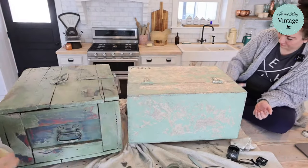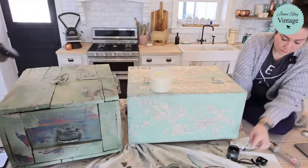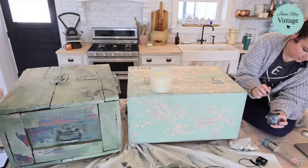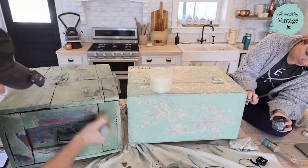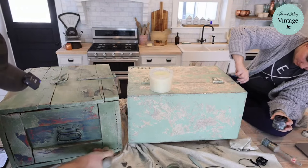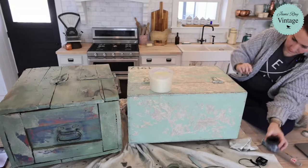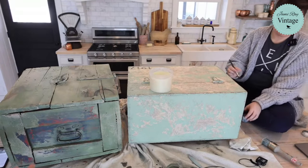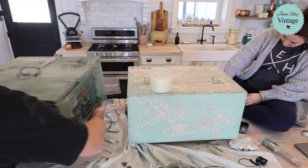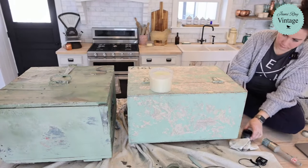So Angela asked if you can use wax over stain. Yeah, just let the stain dry. The wax will cure up just as well over stain too. Nice thing about wax is the adage is you want to wax last because it needs to breathe, especially as it's drying. So whatever you've got underneath, whether it's paint, seal, you can wax over other sealers too if you want more of a matte finish. Stains, milk paint, it goes pretty much over everything. Just make sure it's your last step.